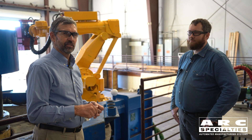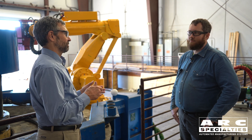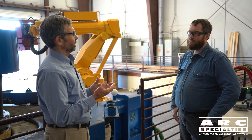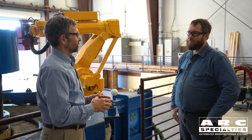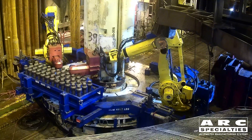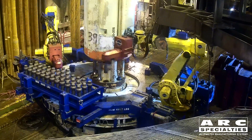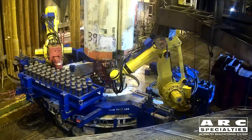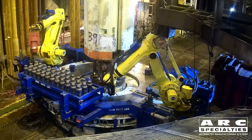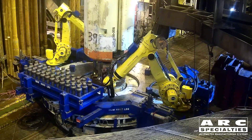This one's a little bit different today. This is an offshore robot running on drill ships, and Jim has been on these drill ships 14 times. So this is bolting and unbolting riser — the riser is what connects the drill ship to the seafloor and the BOP. In this application, we're picking and placing 55-pound bolts. When we thread them in, we end up torquing them to 18,000 foot-pounds. When we un-torque them, we can un-torque them up to 36,000 foot-pounds if they end up that high.